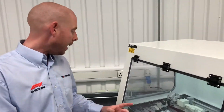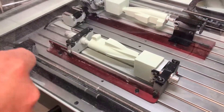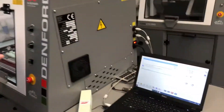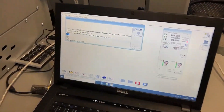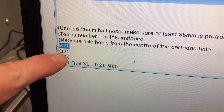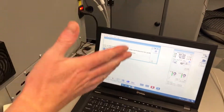After cutting the right hand side, we're now going to cut the left hand side. As you can see, I've turned the F1 car model over and now we're going to run the left hand side program. The only difference to the right hand side program is that this one has an M71, and that's a mirror command that changes the coordinates for the other side.